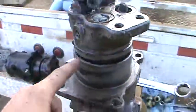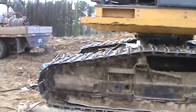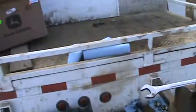So that's the old one — it's leaking right here, and it leaks through the bearing and pukes through the bearing. We've been running on a bearing that's been lubricated by hydraulic oil for the last few months rather than grease, which hasn't been very good.